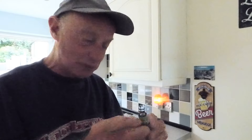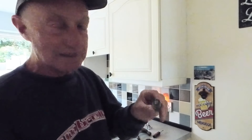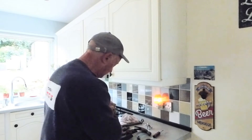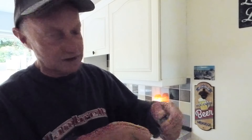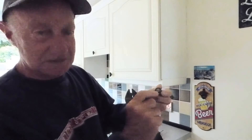Once it's off, you'll look at it and go - how am I going to get that washer off of there? As you can see, that's a nut on there. Spray it all with WD-40, and once again get a nice tight fitting spanner that you can get on the end of there and get a tight grip on it. Clean it all off and then you can undo that - it will spin off. That washer will be as tight as anything to get out - I will warn you of that, they always are. Once you've got all that and the right washer on there, you can put it all back in.